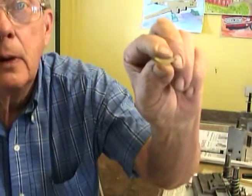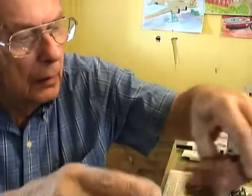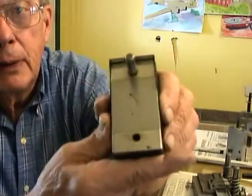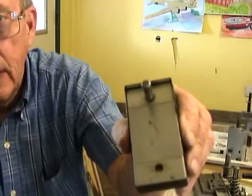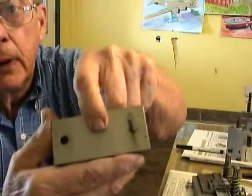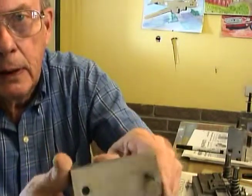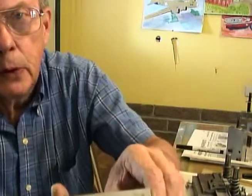The other thing we have to do is anchor those pins inside the door. Here's a little brass pinch plate made to fit inside the car body, just like this. There's a tool for making those, and they're very time consuming. My friend in Minnesota made a die for punching those out — you can see the shape of the die there at the opening, and the other part of the die has the punch. Once the hinge pin is made, you remove a part here and put it in the press again. You get the hardened steel pins and punch a hole in the brass plate.